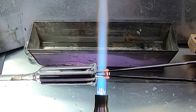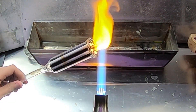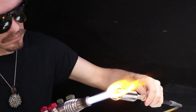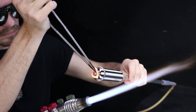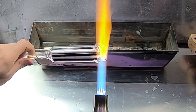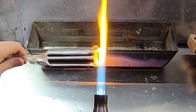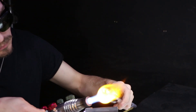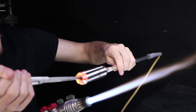I've kind of attached my tube to the vacuum early — it helped to seal the piece up first. I should have let the kiln warm up a little bit also; I only let it get up a few hundred degrees before I started working on it. But now to seal it, you would normally just melt the end all together and then attach a blow tube. I'm going to try something a little different with that longer tube — I'm going to see if I can flare it over my rods. That worked a little bit better than I expected. It kind of flared over all the ends, and the metal piece is still open to connect to a blow tube. Now I just have to bring that inner wall to the outside wall, using the jacks to push the glass up and a paddle on the outside to push it back, sealing up the tube and giving me a closed system ready to vacuum out.